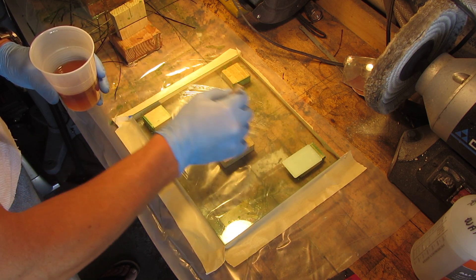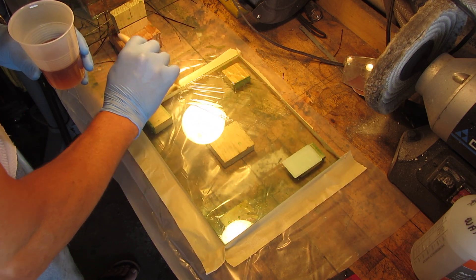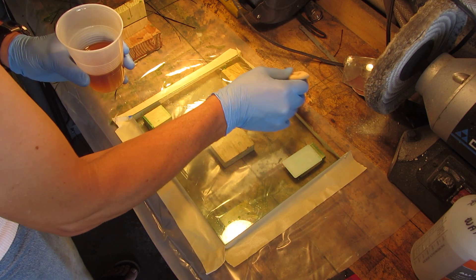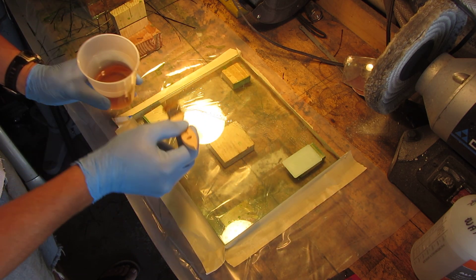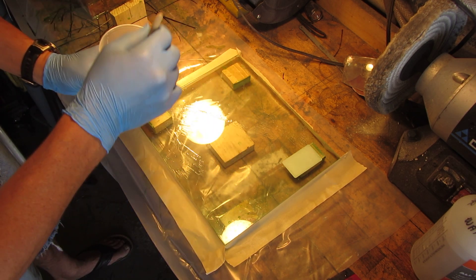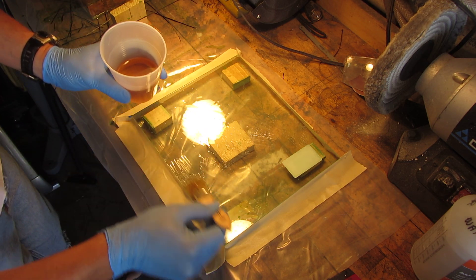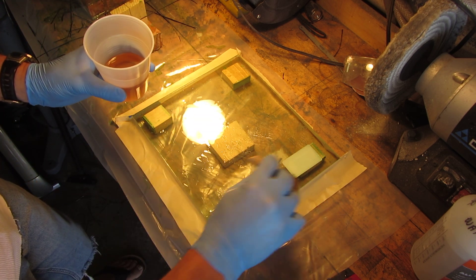Start the equation by putting out the first layer of epoxy. The first time you put this out, there will be a tendency for the epoxy to be thicker than it should be because of the viscosity and friction between the glass plate and the epoxy. What I'm trying to say is you're going to use quite a bit more epoxy on the first layer. Then everything gets saturated and the epoxy in the matrix results in substantially less friction and thus less epoxy used on the sequential layers.